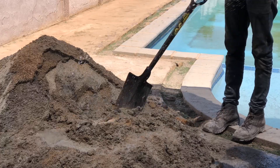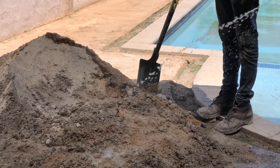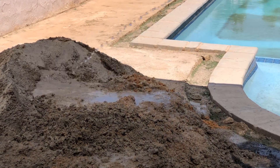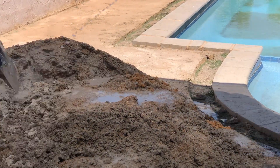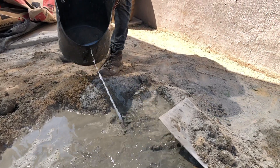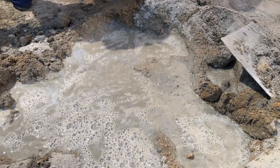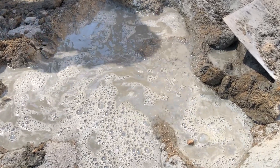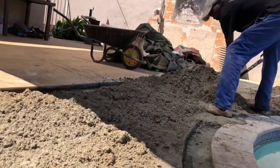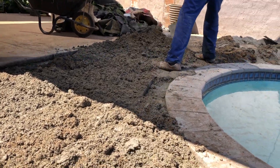We're currently mixing up a screed mixture directly on the floor. This is a river sand and cement mixture — you could probably use a plaster sand mixture as well — but the depth that we had was pretty significant so this was most suitable. We also add a binding agent, or what we call plaster key, which helps it adhere to the existing cement surface, and that gets mixed in thoroughly. Once our mixture is thoroughly mixed we can start applying it to the areas, moving it around before we start leveling and getting the right slope for water to drain off.